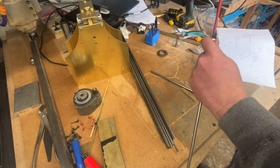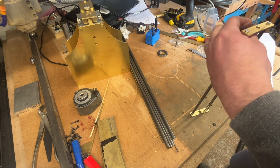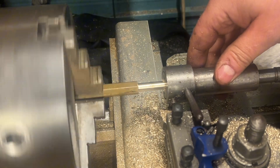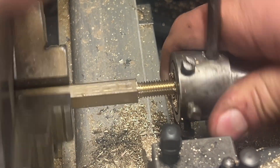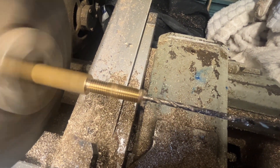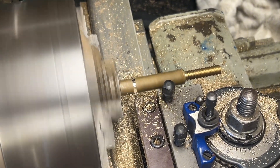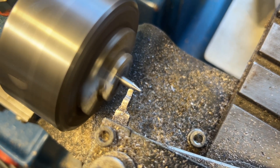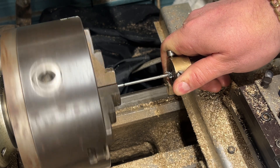With those parts constructed, it was a chance to assemble the top section of the pendulum piece. Moving on to making the brass compensator piece, Steve's new design has an extended threaded section which I went with at 8mm. The compensator piece is drilled all the way through, then tapped just in the top section to accept the lower pendulum rod. The bottom end of the pendulum rod was turned to a fine point - quite a length to fit in the lathe with a lot overhanging - and both ends were threaded M3.